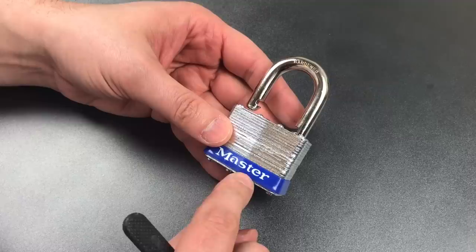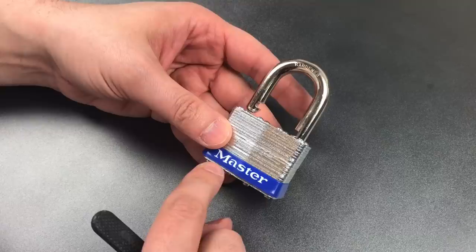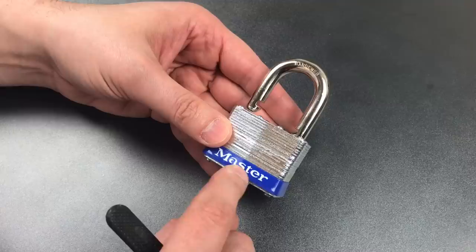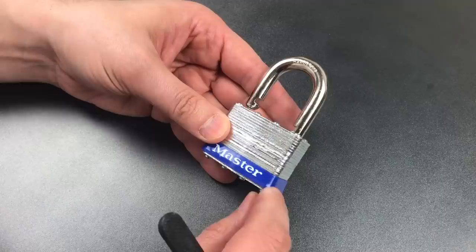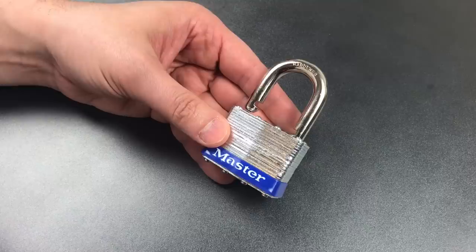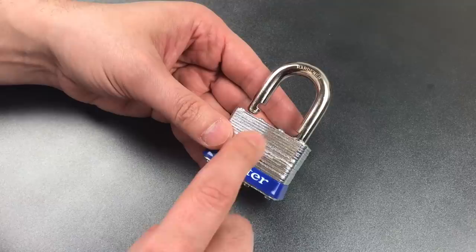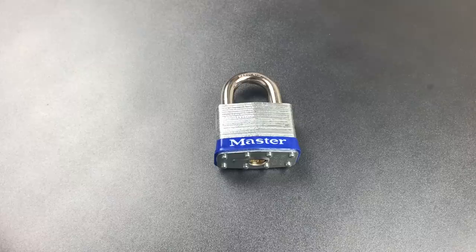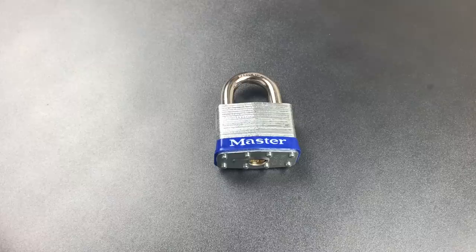That was definitely not a normal Masterlock pick. It felt like serrated pins but not like an American Lock pin or a Pac Lock pin — the feedback was not nearly as crisp and clean. It almost felt mushy on the inside, perhaps even like I was bending those pins, which doesn't seem unreasonable considering how thin they are at their very core. Because of that I have some concerns about the long-term durability of these locks, though I've never used them before and have absolutely nothing to back that up other than a gut feeling. If you do have experience with these locks I'd appreciate if you could chime in in the comments below. In any case, that's all I have for you on this Masterlock Model 5UP. If you have any questions about this or the universal pin mechanism please put them below, and if you like this video and would like to see more like it please subscribe. As always, have a nice day.